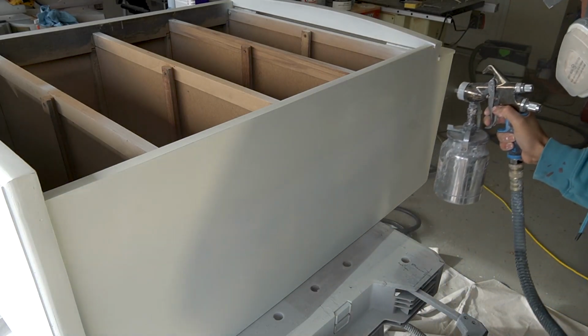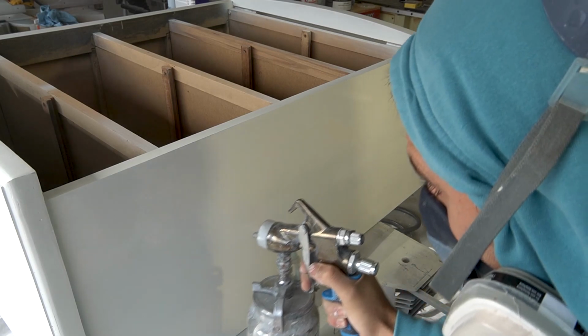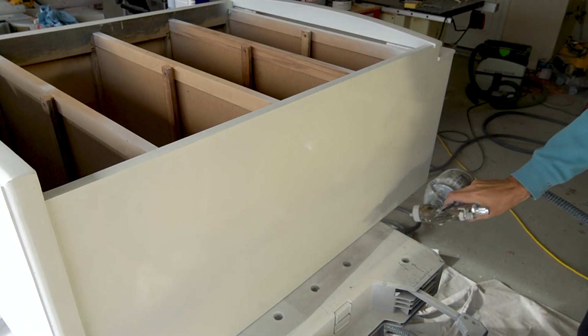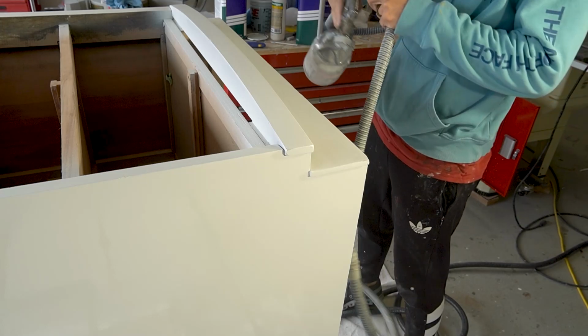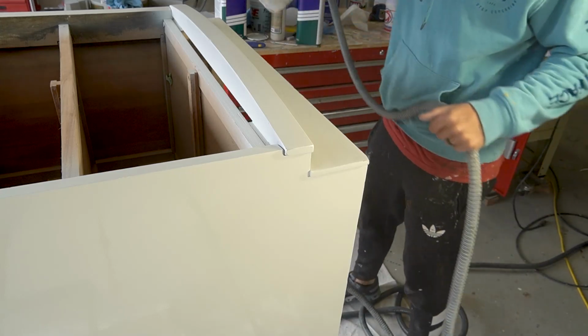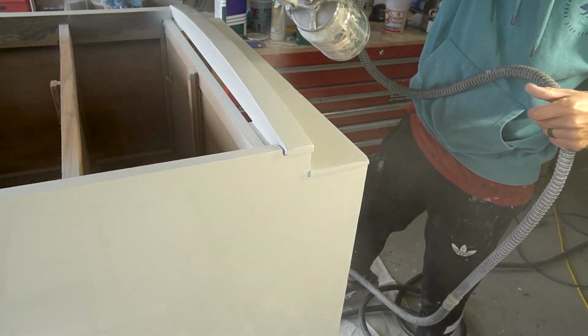This lacquer is just a catch-22 to me. Sometimes it feels like it's drying really slowly, but at the same time really fast. I try to put on as thin a coat as possible while still allowing the lacquer to connect so everything levels out nicely. But sometimes it doesn't happen and you just get an area of dry spray.